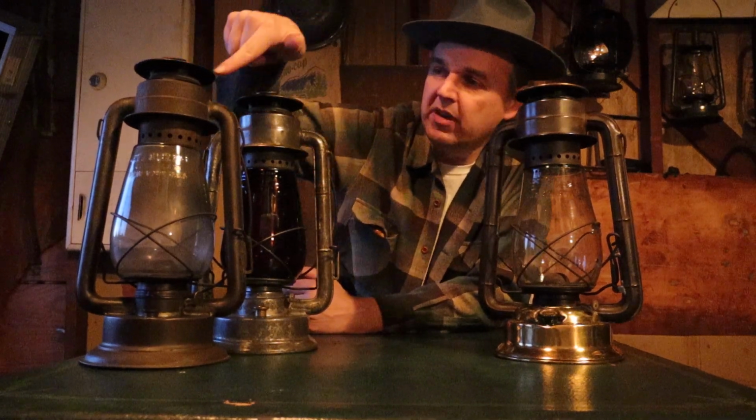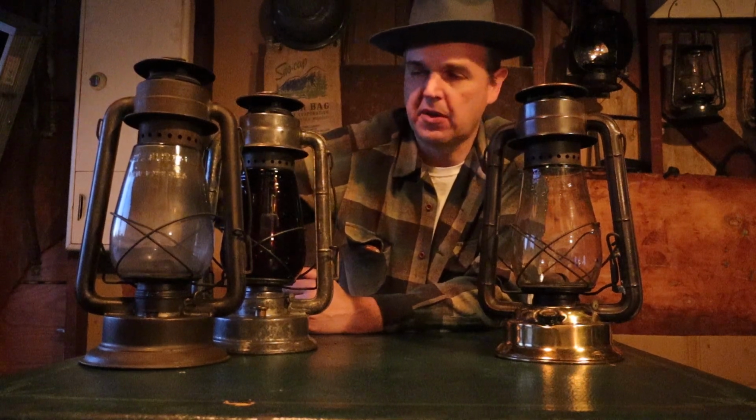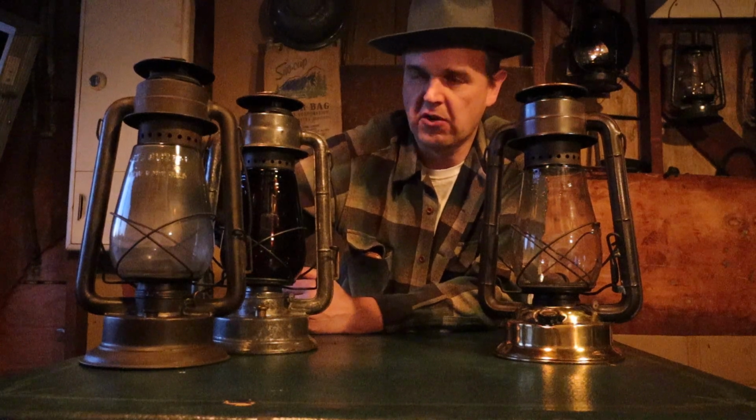Anyways, moving along, we have 4 long horizontal slots in the top of the crown. This was a design for only this period. For the first couple of years of production, they did that. Soon they went to more multiple. They went to 8 slots. Okay, so the 8 slots actually provided more strength in the crown. So less metal means less strength. So they had to reinforce it.